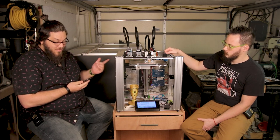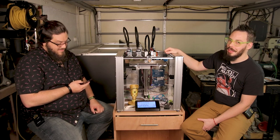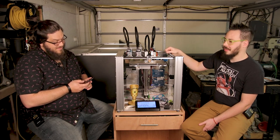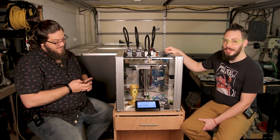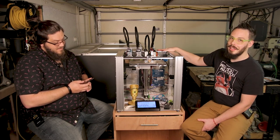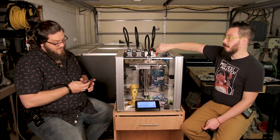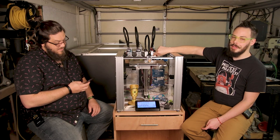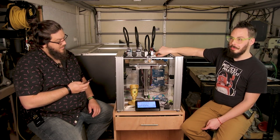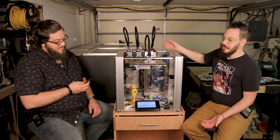All right. First one, closed loop motion controller. I mean, you could. It's hard, mostly because firmwares don't set it up. You don't need it. The steppers are really good, especially the ones that the retail version ships with, which I don't have. But being off a half millimeter or even a quarter of a millimeter means you crash when you dock a tool. I don't crash when I dock tools, so it's good enough.